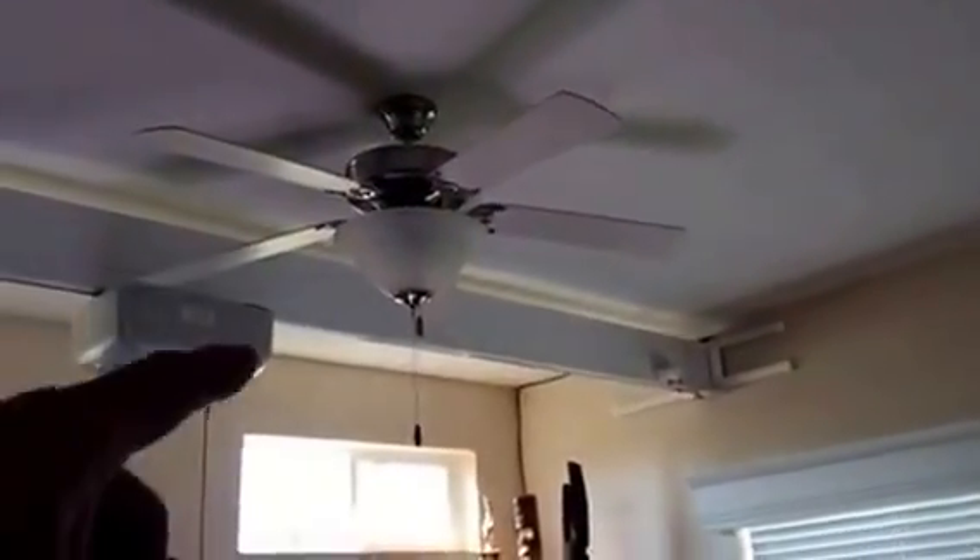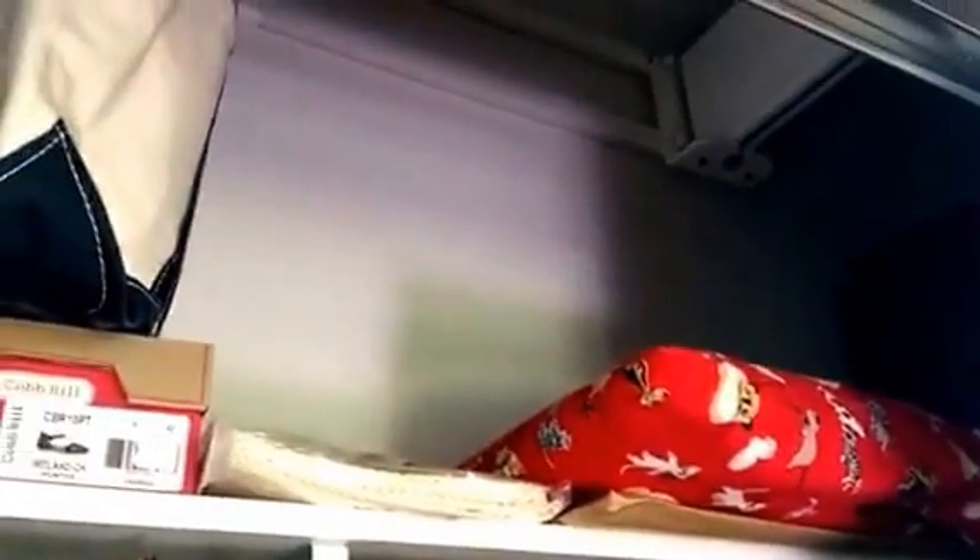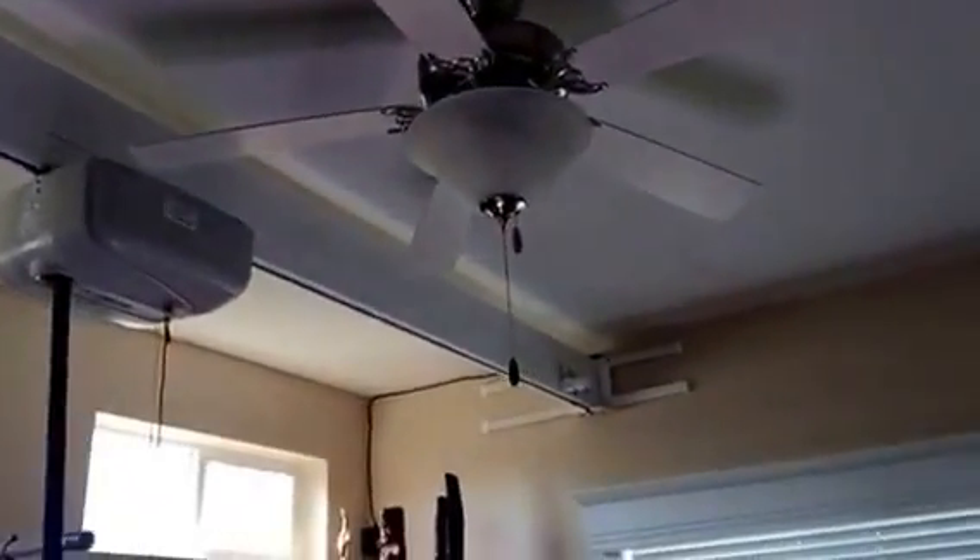There we have the beam — the wall-to-wall rail — expanding from that side of the room all the way across and through the drywall here on this side, so the actual bracket to hold it is inside the closet. We have two pieces of strut running across the joists, the ceiling, and the wall studs, and that gives good support for that bracket to hang on to. The beam then comes all the way through the closet to the opposite side of the room and holds it there.